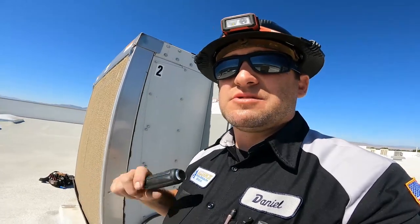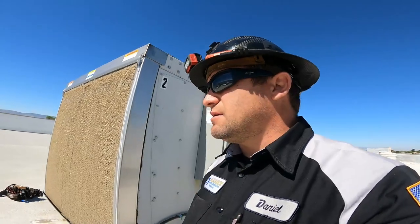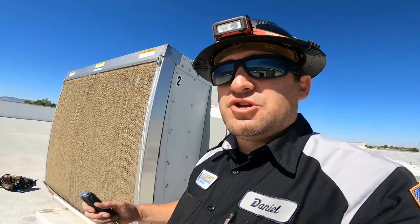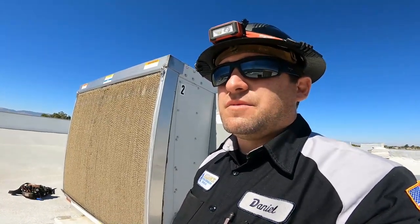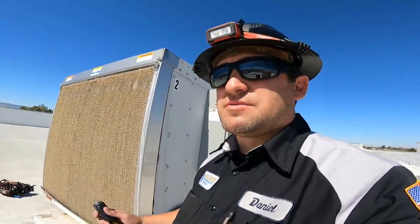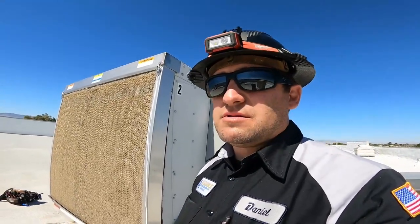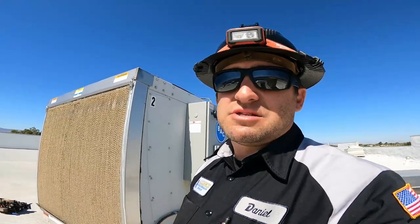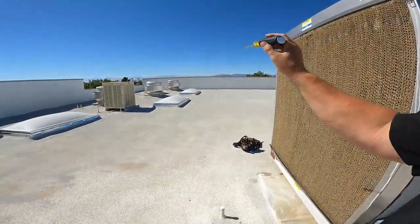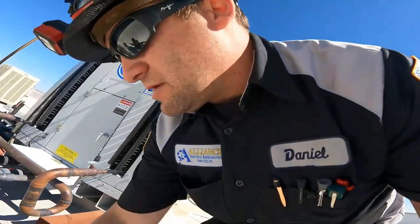We can't go in. There's my customer's products all around. He has boxes and stuff, and that's a lot of editing I gotta do. So to let you know, they're Bitzer screws. There's two of them. They run off the 201 cards, the original compressor controllers, and it runs off a Dixell thermostat the customer can log in and out of. The system's basic, simple: solenoid, thermostat does the solenoid and also does the defrost heaters. That's it. He has a problem with that exhaust fan over there, so we're gonna go take a look at that exhaust fan. So let's put this back in here.